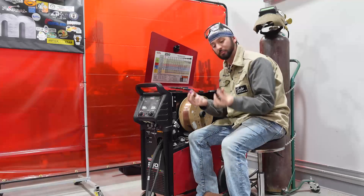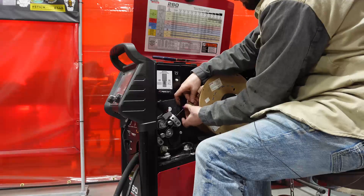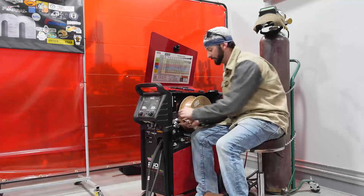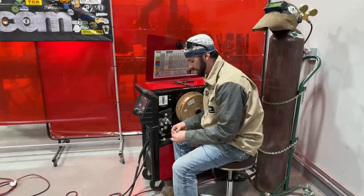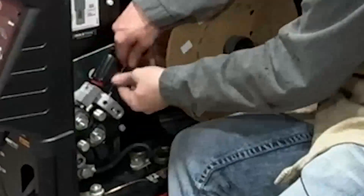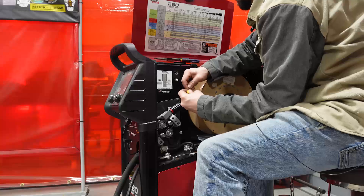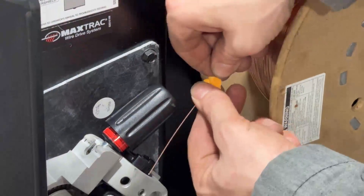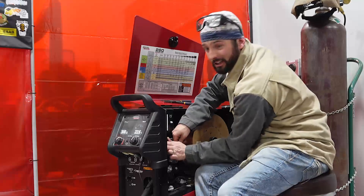It's really simple to use. You just pop off the cover, slide it over top of your wire, put your little metal clamp back on, and as that wire feeds, it gets pushed to the front of the unit and every time it gets pushed through, it gets wiped off. If you don't know where to get one of these fancy wire cleaners, that's no big deal. Grab yourself a set of earplugs that every shop has, back that wire out, pierce the wire through the earplug out the other end, and now you've got your wire cleaner without all the drama. Keep your wire clean, your metal clean, good ground, and if you've got a good connection, you should have a good weld.